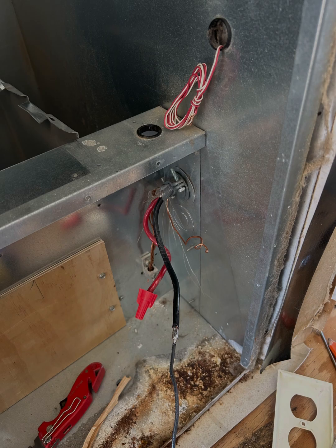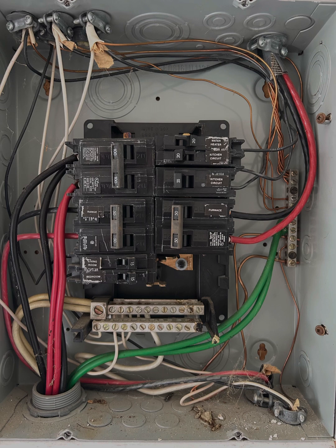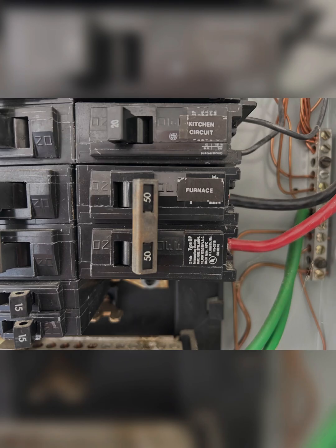What I'm doing is I'm going to utilize this heavy gauge wiring that's already there and step it down from 220 to 120 volts. You can see there's the breaker with those two wires — those are both hot wires because it's a dual phase circuit. I'm going to be pulling this breaker out and getting the appropriate Siemens breaker for the box. Apparently it's pretty important that you have the same brand breaker for the box that you're using.